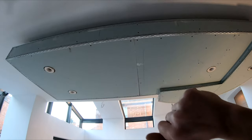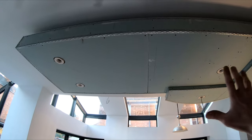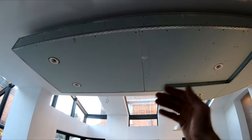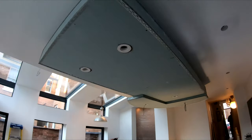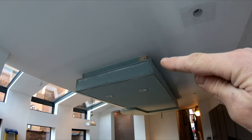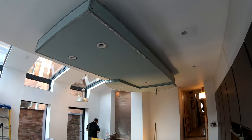The reason we've left this like this is purely for plastering — it makes it a lot easier to skim it as one complete board rather than cutting the extractor hole out first and then skimming to it. It'll give us a much better finish, so it can just be cut out afterwards and the hood will fit perfectly to it around the edges. There's an LED strip which will go all the way around, and just a little bit of plasterboard missing where we need some connections for the LED strip. Apart from that it is good to go. Today is the day we plaster the bulkhead — you've seen the process of building it, so now the final thing to do is get it plastered.